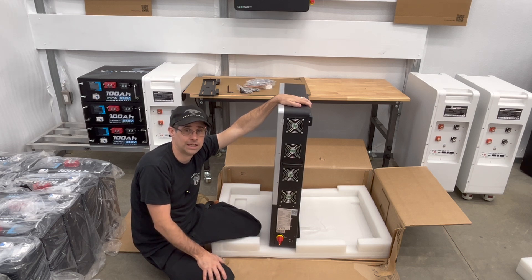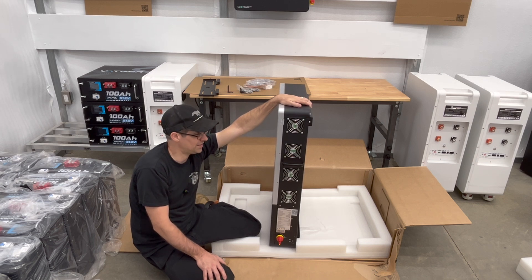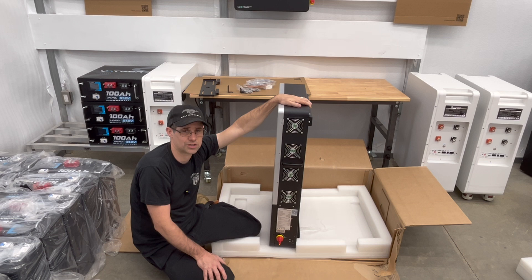So I do have five of these now and I'm looking forward to having them all hooked up. I tend to purchase my inverters from Signature Solar. As of the recording of this they're still $2,499, which to me is a steal compared to everything else. And these do have a split-phase 240-volt output, so you don't have to get some sort of combiner box to take two 120-volt inverters and make 240 out of them. It's really neat that it's 240 right out of the box, and you can easily parallel these just like the 6000 XPs to get whatever power level you need.